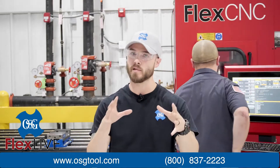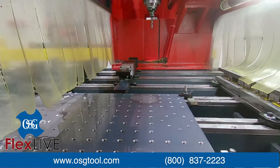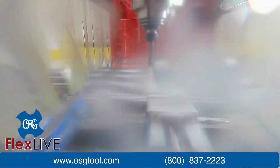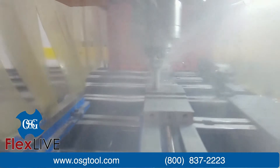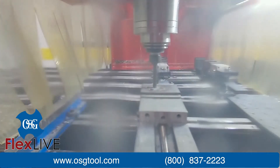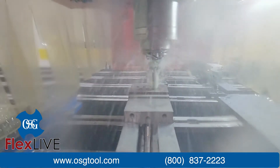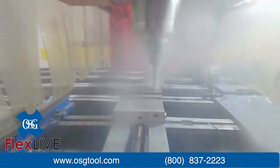The ADOTRS is part of our A-brand drilling lineup. There are three things that are really good about it. This is a three-flute drill, which is going to enable you to run at really extreme feed rates — this drill is going to be able to handle 40, 50, 60 inches a minute, no problem. We have a special grind on the gash, and the coating is a multi-layer nano coating. Look how fast that thing goes — this sucker is flying!